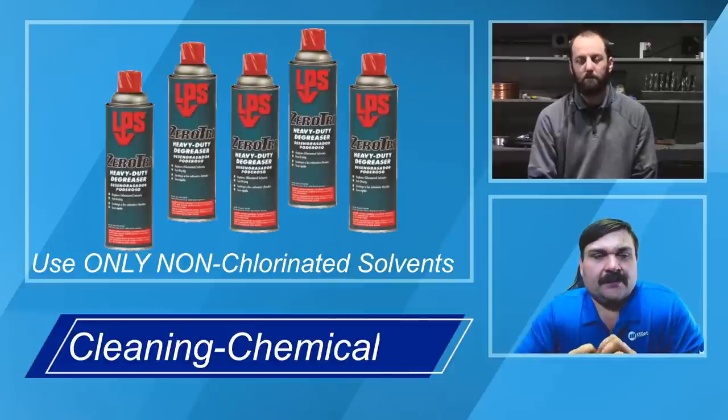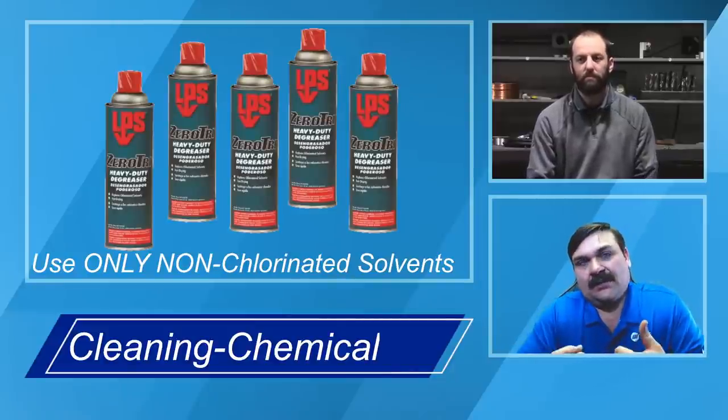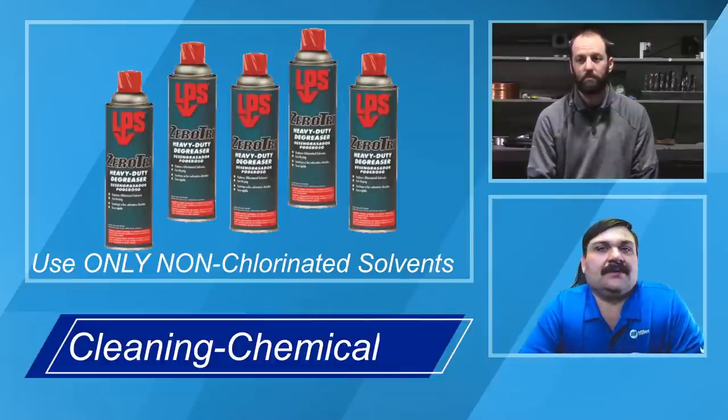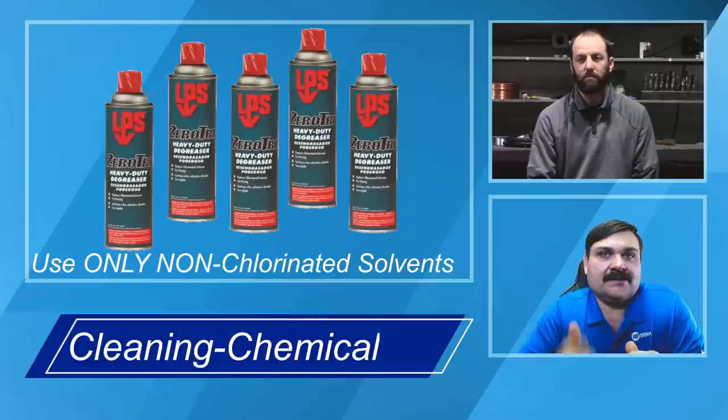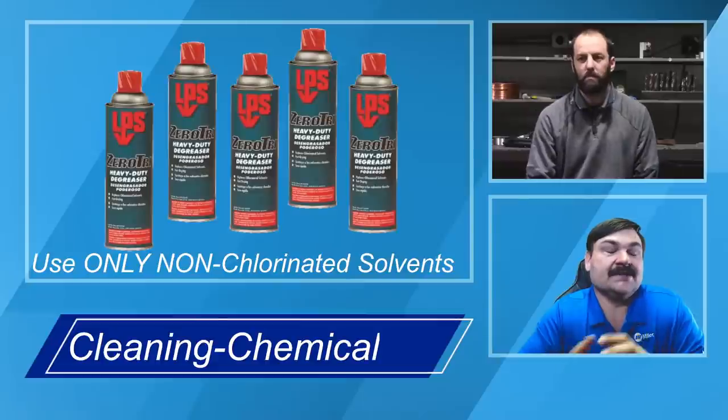And we'll talk about your edge prep a little bit too, but if you're thinking about a plate, it's not just the top of the plate if you're on a weld joint. It's going to be every side that might get up to temp within that weld zone. So it's the top of the plate, the side of the plate, the bottom, whatever that joint looks like, you want to make sure you're cleaning all sides of that surface as well.